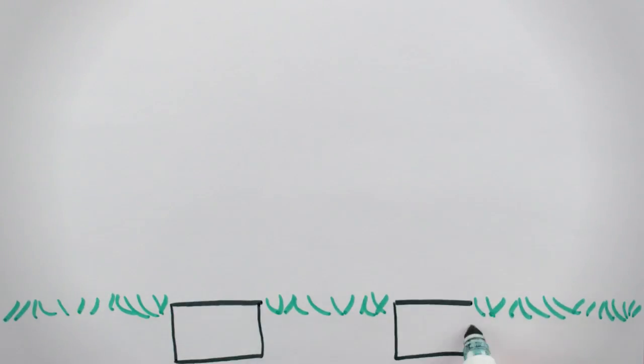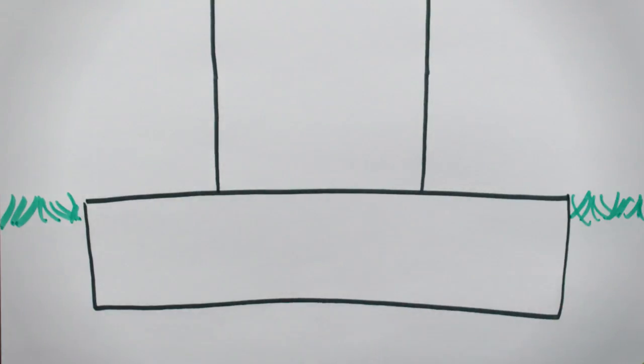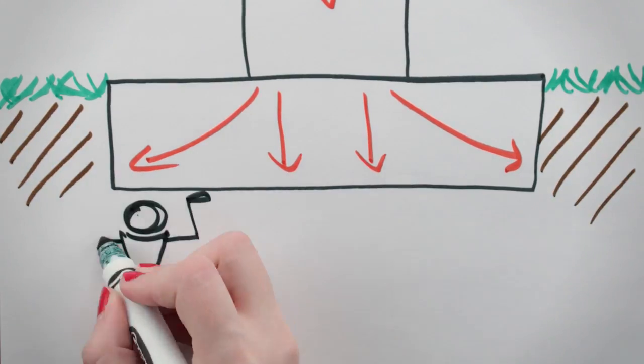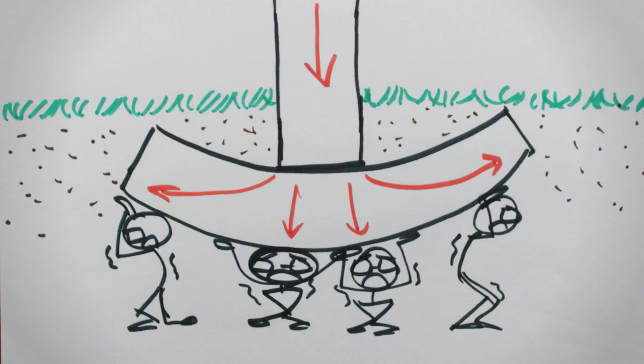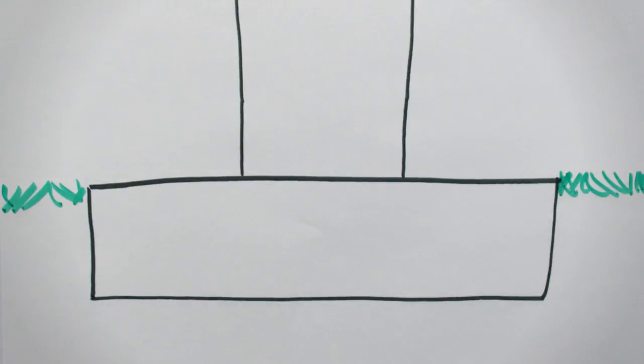Concrete footings under columns are used to transfer building loads to the ground below. As the load moves from the column to the footing, it tends to spread out. And the size and thickness of the footing, therefore, depends greatly on the type of soil supporting it. A stiff, clayey soil may support a higher load than a sandy soil, but each type can cause different behavior in the footing. Two conditions must be considered in the column footing regardless of its shape.